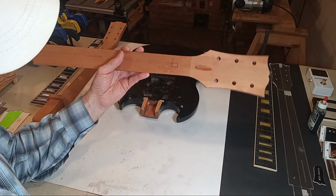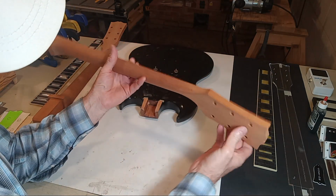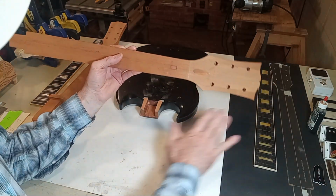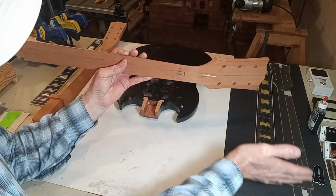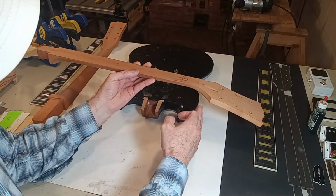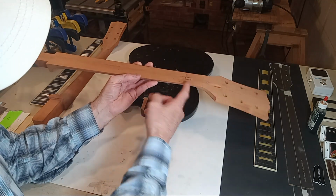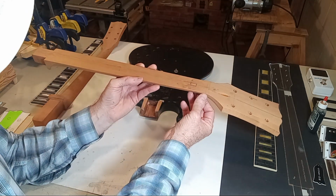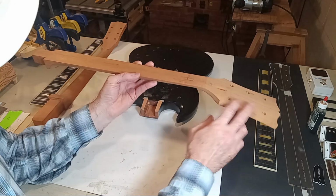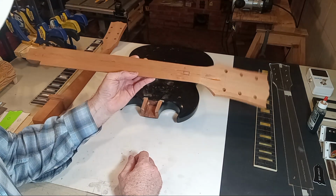So, not being melodramatic there, it's just I learned my lessons from like 25, 30 years ago when I started doing binding, where it's really best to just do all that type of stuff in component form, and then you're ready to glue that component down, even so much so that you're already cutting your overlay on that pitch to meet the 14 degree. You could look at it as either a 76 degree or a 14 degree cut. When I'm setting up my miter saw, I'll be cutting it 14 degrees.